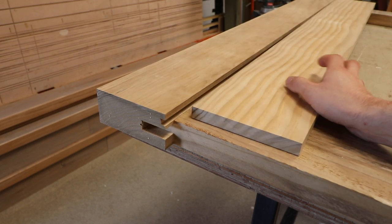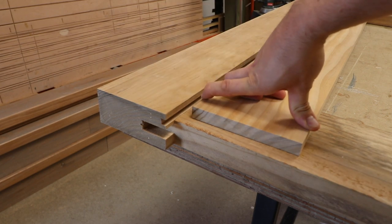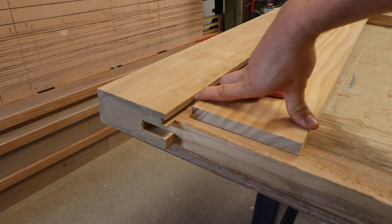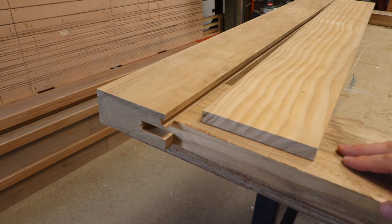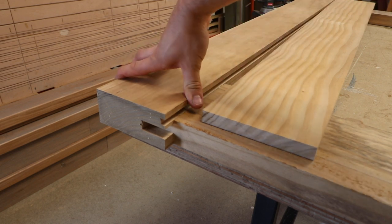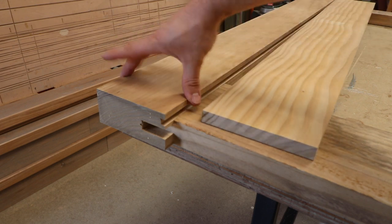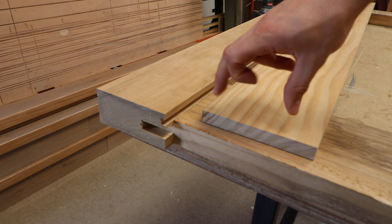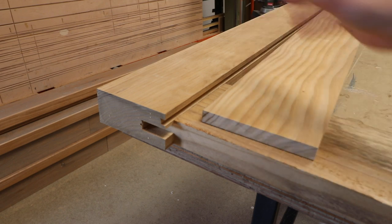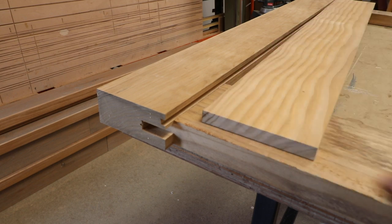If you want to be really clever, you can make your styles full thickness of your board. Before you start the job, work your widths out and work it so that it will work out to a timber size matching the widths of the board. So if you've got say 125mm timber, you might want to finish the styles at 110mm, and then you could get 110mm out in the boarding as well. It would look uniform across the door like it was boards all the way through, even though the side ones are the bigger styles with boarding in the middle.